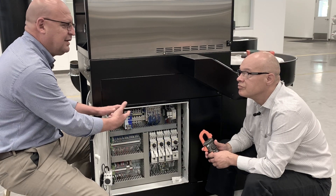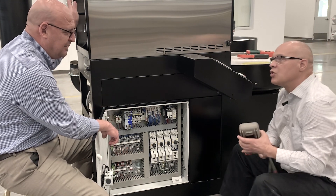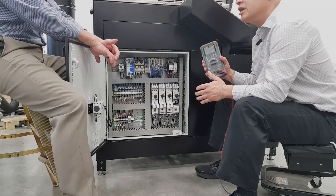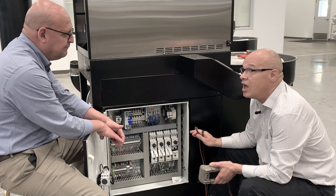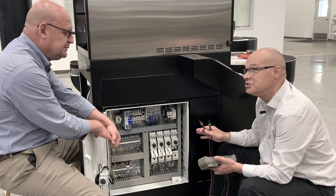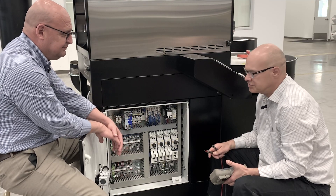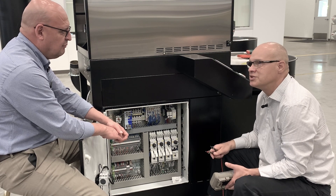Is there any other electrical aspect — is it tied in with the security of the switch on the top? We do have some safety checks to make sure the motor is working properly. One of the other important tools is a voltmeter — just a standard voltmeter, you can get them at any hardware store. If you're an electrician, you can check the voltage yourself. If you're not and you're calling us for support, if you have one of these, we can help you with where to place your probes and what type of voltage you should see. You can also check continuity to make sure your wire is still intact, and then check to see if the voltage is correct.